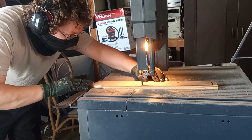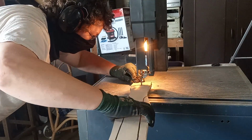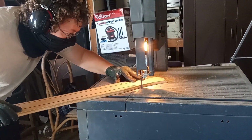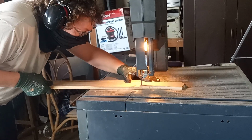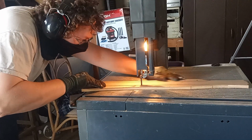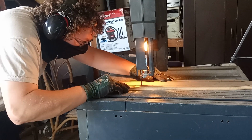But screw that side profile, did he cut a Gibson headstock? Well, yes and no. I cut a Gibson headstock so accurately that the left side horn is taller than the right side horn, because the way they used to route them from left to right, the corner would get eaten off. All the old 50s ones are that way. I didn't put the open book on it. It's just a little round circle. I mean, but if it gets chipped once the guitar gets made.